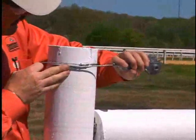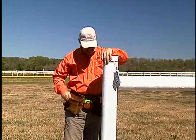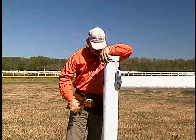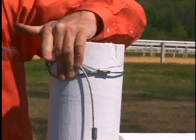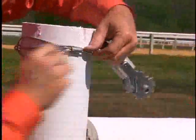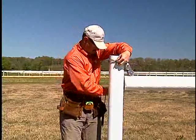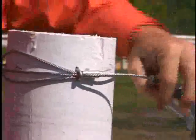I'm going to take some of that slack out so I get this back nice and close. To keep that loop from coming back around, I'm going to drive a staple in right here. Drive it up just until it touches, just right at the cable itself — I'm not trying to bury it. Give it one more tug to get as much of that slack out as we can, bring it back around. That one right there is ready.